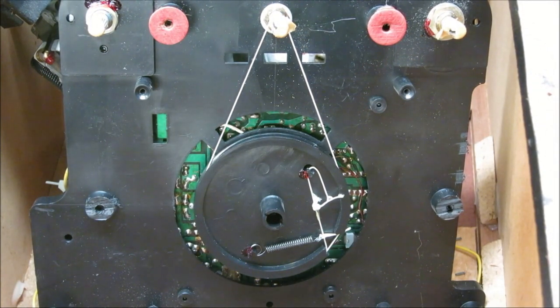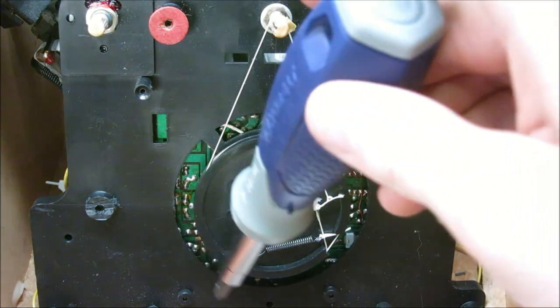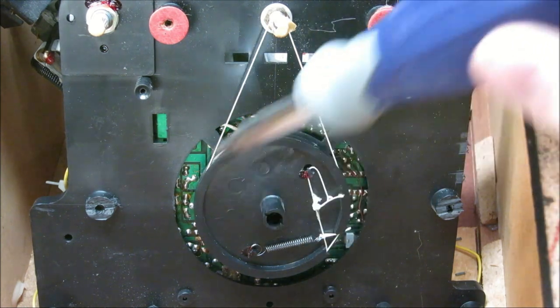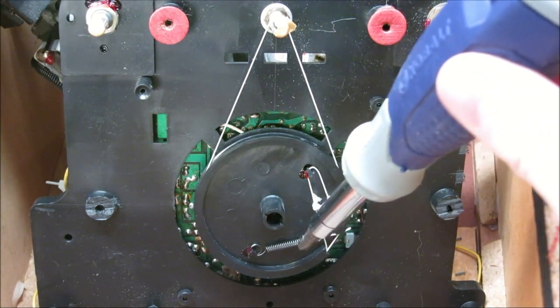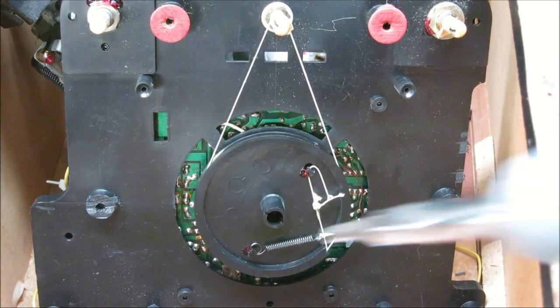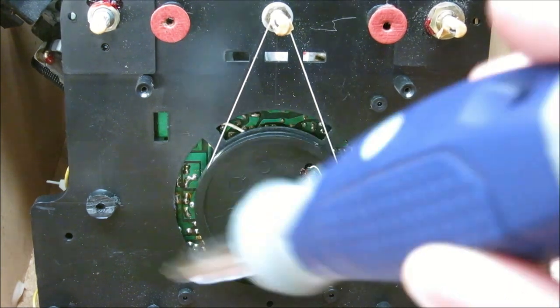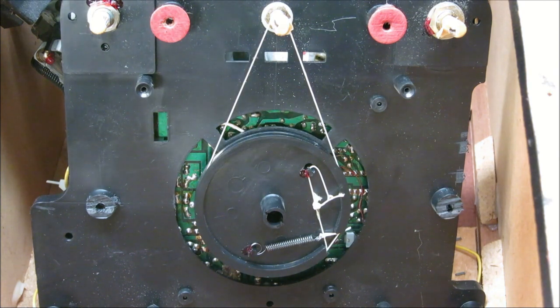Once you've gotten your string back on the track, all you do is make a loop from the spring, go around and loop around here, then go back around and clip it on there. The string starts here, is tied on there, makes a lap around through there, loops around, then comes right here to this spring. That spring keeps tension in the line so it's always tight - whenever you turn the knob you actually get the dial indicator to move with it. When putting this on, grab a pair of needle nose pliers and pull the spring so the string is real loose and easy to wrap around. Once it's all wrapped on and you let go of the spring, the spring takes up all the tension and does all the work.